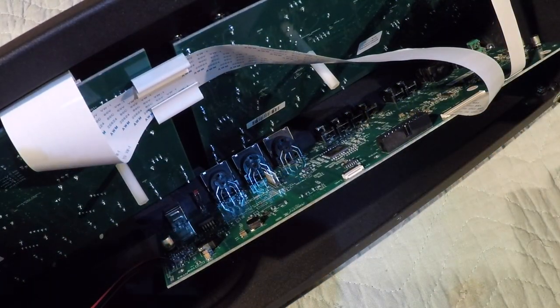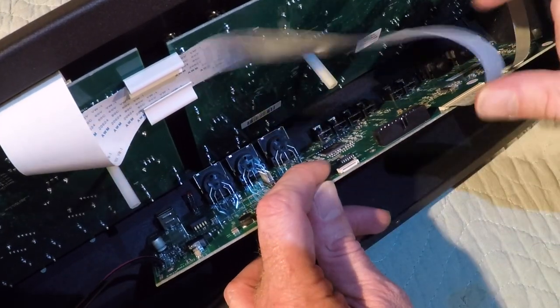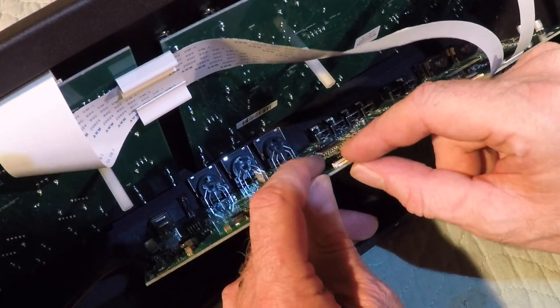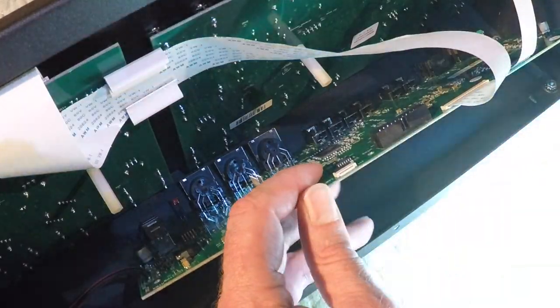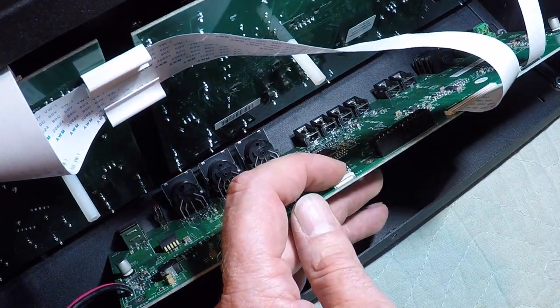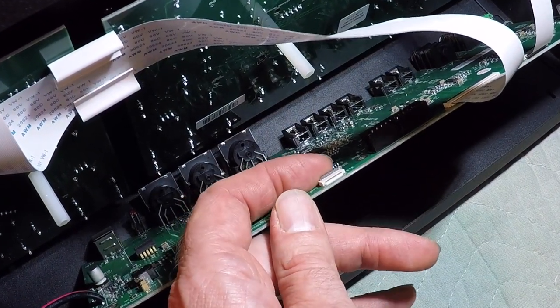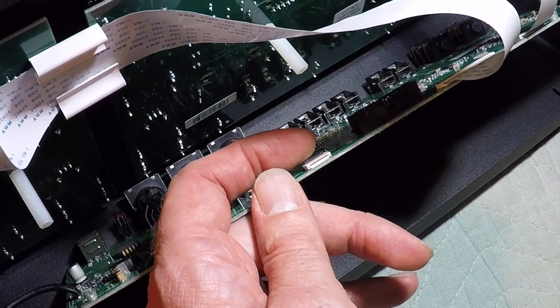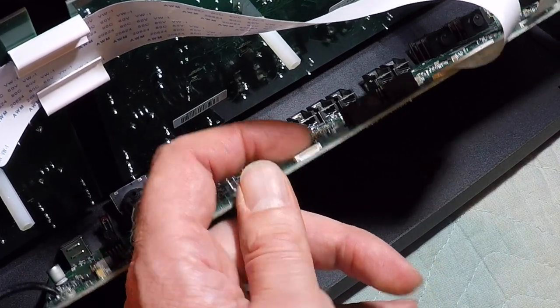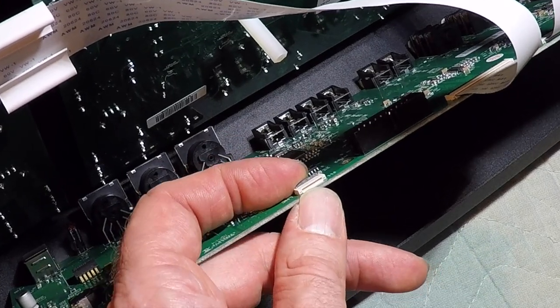Okay, I just figured out my first mistake. The little ribbon cable here, same with these bigger ones, I thought just pulled directly out. I was wrong, and there is actually a little clip in there. Luckily, when I pulled it, it released, but I should have reached in and pulled the clip towards me, or towards the camera this way. Pushed back, it's locked, and then pulled forward.